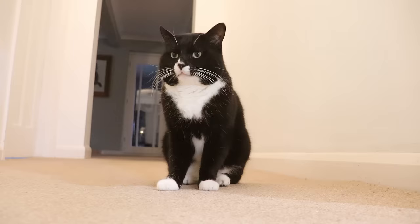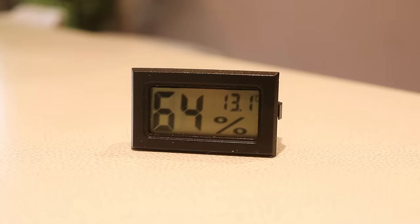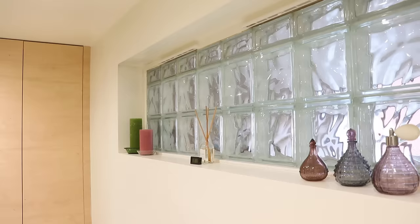The first thing I did was to invest in some of these humidity sensors. These are really cheap especially if you buy them in bulk, which is what I did because I wanted one for each room, which allowed me to monitor the readings and determine where within the bungalow we had issues with high humidity levels. I'll leave a link to these in the description box below — they're really handy to have around and they also have a temperature reading on them too. When we first moved in I took readings over the winter months at different times of day over a few weeks and the readings were averaging between 77 and 91 percent, which is extremely high, far higher than it should be. The recommended humidity levels indoors in the UK are between 30 and 60 percent and readings above 70 percent are likely to result in mould growth.